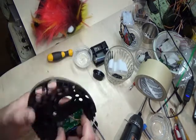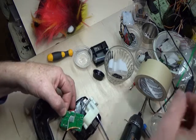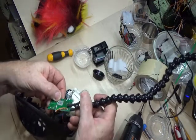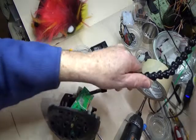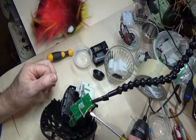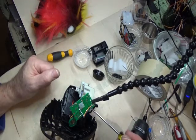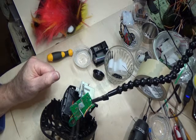This is going to require some pretty delicate soldering, because you're soldering on the circuit board — it's got one of those integrated switches. I'm using a stereo cable, so we have three wires: a red, a yellow, and a white. On this particular stereo cable, the yellow and the red are the ring and sleeve, and the white is the tip.